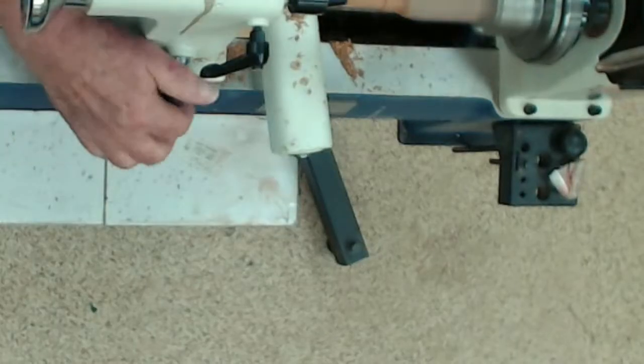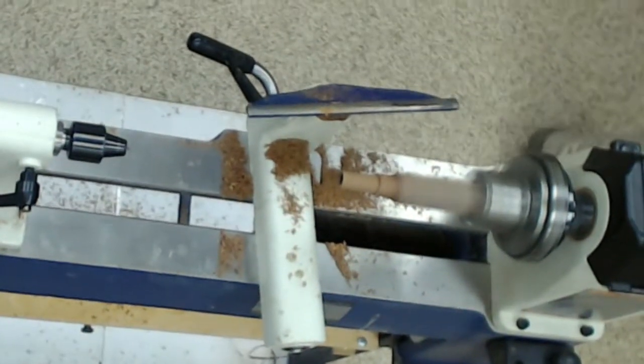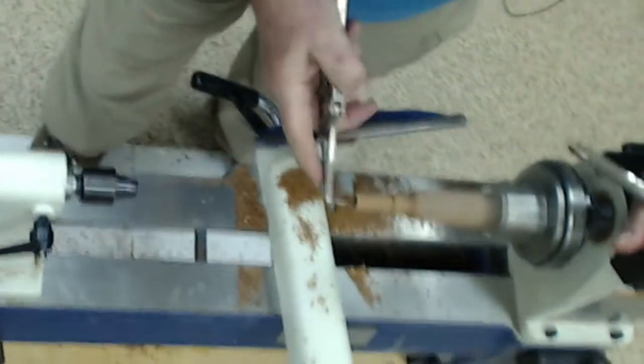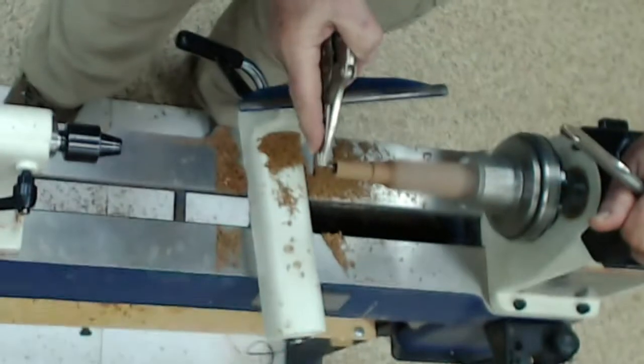A key thing whenever you're making these on this cap is before you turn it down to where you're going to turn it off, you've got to bore a hole through there for the little bitty eye screw that goes in it. So another high-tech tool, small nail.